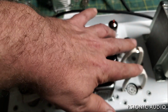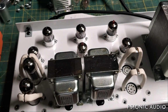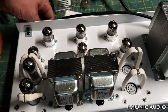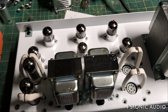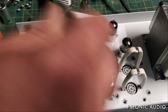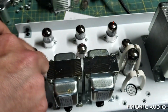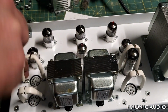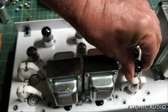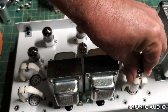and make sure there's no problem with anything in these sockets. That'll tell us part of it. The next issue is whether one of these other tubes has failed or if there's a multi-layered problem here. I'll take these out. I did not see anything on the circuit board that would point to some complicated circuit that would require both sides to be fully operational.